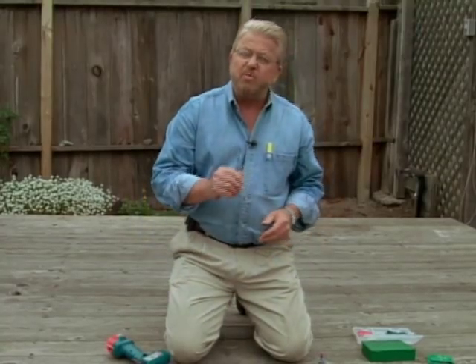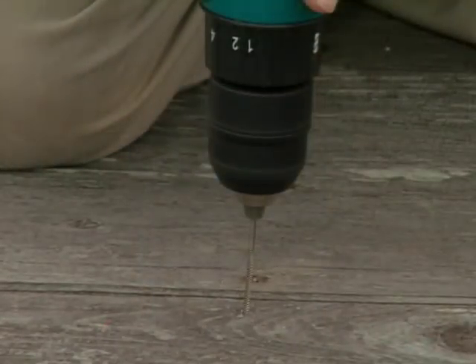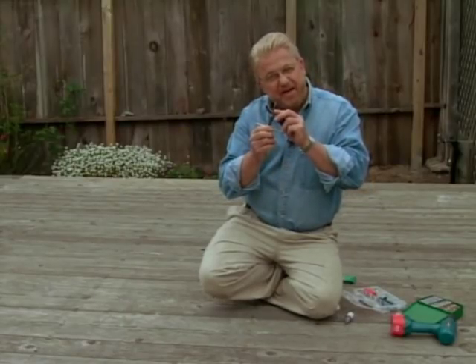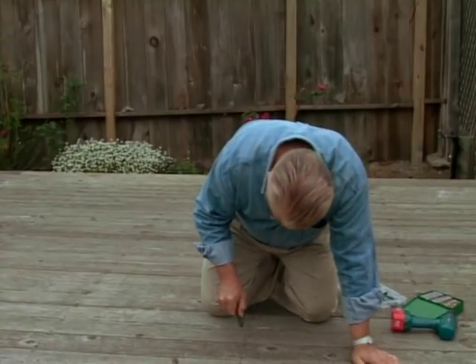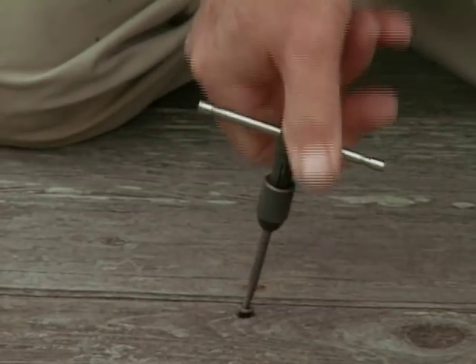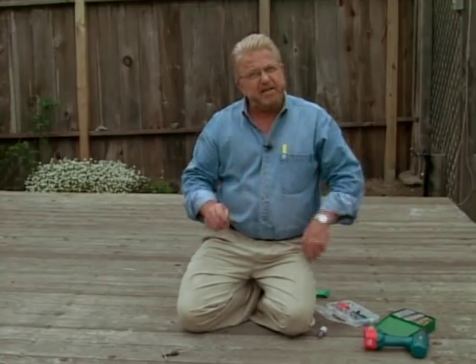If this doesn't work, you might try a screw extractor — that involves two steps. First, you've got to drill a small hole in the head of the stripped-out screw. The second tool is the extractor. It has a tapered, coarsely threaded shaft. You put it right in the hole you just drilled and turn it counterclockwise — it sort of bites in and eventually starts to turn the screw. So if you've got a stripped-out screw head, now you've got at least a couple of ways to get those troublesome screws out.